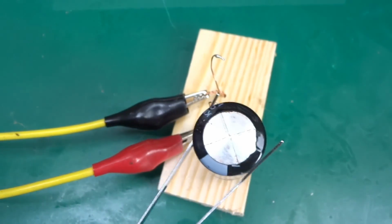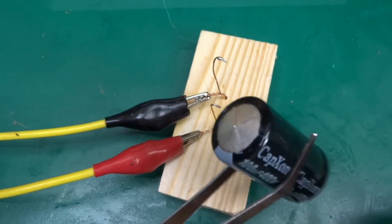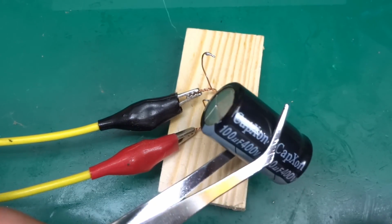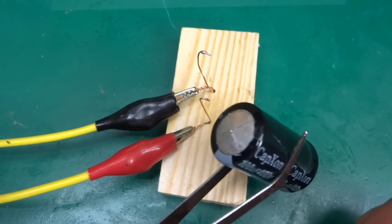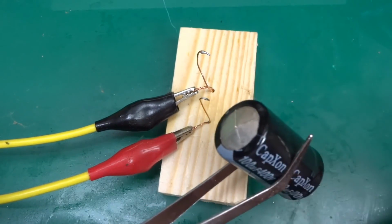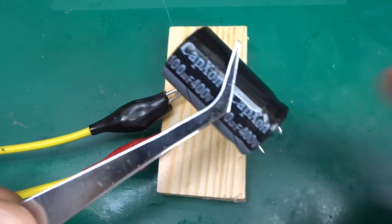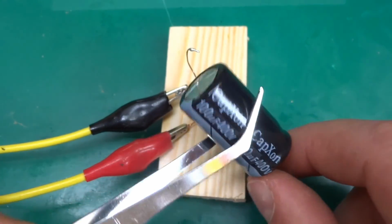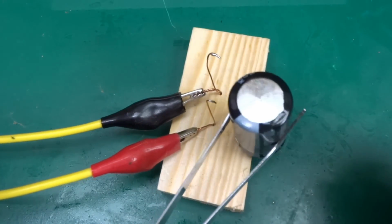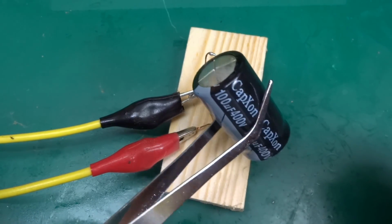But yeah, so as you can see in this video, when you've got slots on the cap, it actually makes a difference. They do what they're designed to do. If you're looking for special effects out of the caps, use the little ones, because they will make quite more of a pop than the big ones, because they usually don't have a venting slot. And usually what happens, they will pop the bottom cap and just fly off. Just be mindful of them flying around, so no one gets hurt. But yeah, there you go. That's what happens when you get your electrolytic caps backwards.